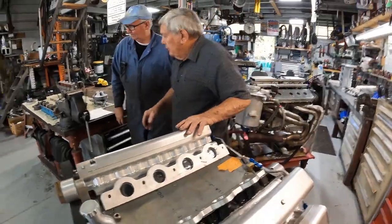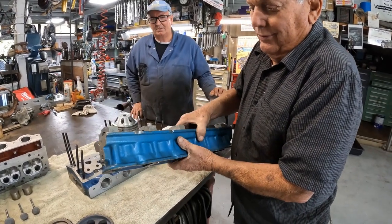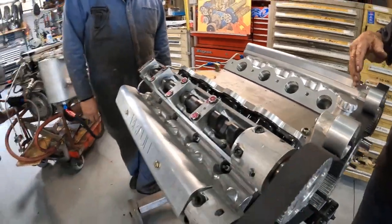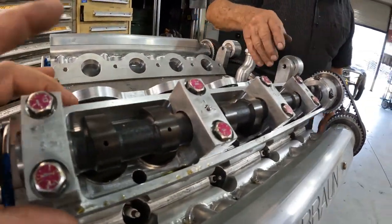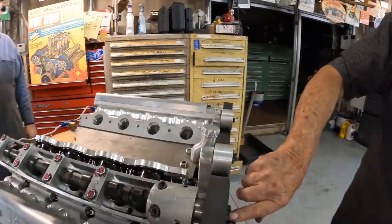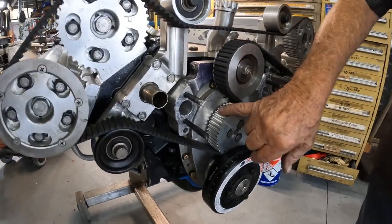In terms of what parts we had — we had head castings and that was it. You need four cam boxes to make it work and I think we got three, and they were all intake-side. So we've machined these on the CNC. The four cam boxes are all slightly different — this side is a little longer than the other — because of the offset. We machined this box. The camshafts are the original Racer Brown cams; we put an end on them to mount the Gilmer sprocket.